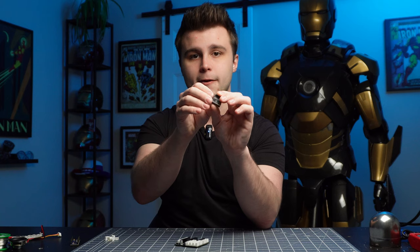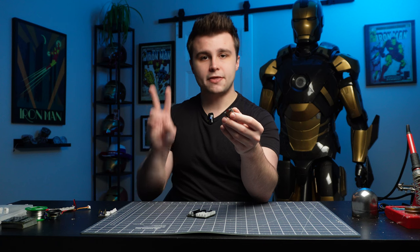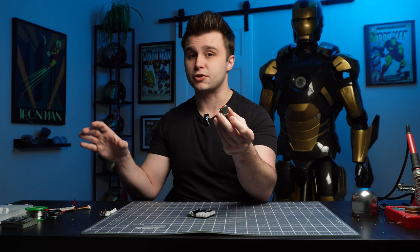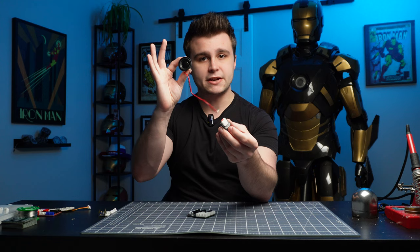The only thing we need to configure is the sound effects on the SD card, which slots in right there. There are a bunch of pins on the back of this but we're only going to be using six of them. The first two are power and ground. The other two are for serial communication — one is the serial transmitter going to the Arduino Nano's receiver, and the other is the serial receiver getting communication from the Arduino's transmitter. Then we have two more pins for the speaker — that's all we need, six pins, to get it working with the CrashWorks code.